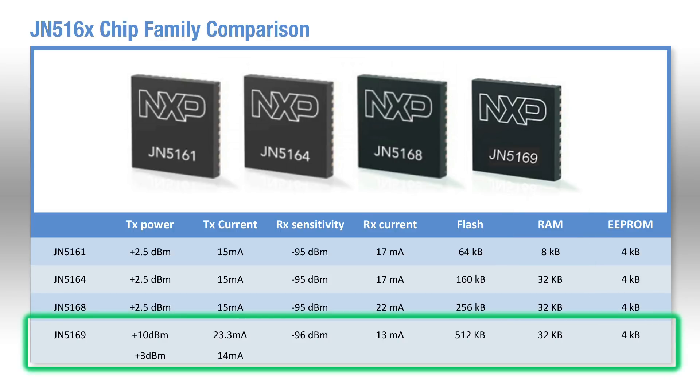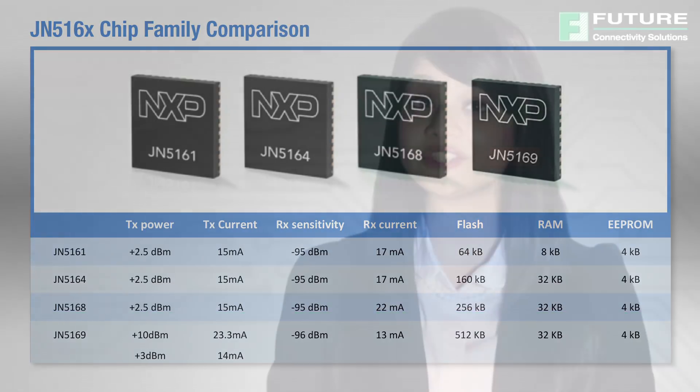The new low power wireless microcontroller JN5169 integrates a 10 dBm power amplifier to greatly extend the operating range of the device, improving the robustness of the connectivity. The JN516X chip also includes a temperature dependent crystal pulling feature, allowing use of very low cost 85 degrees Celsius specified crystals, even in a 125 degrees Celsius smart lighting application.